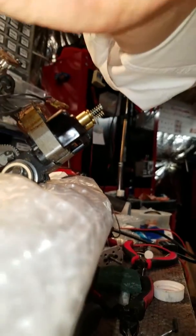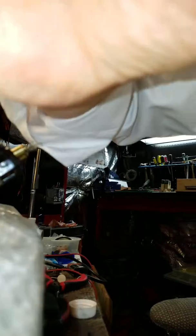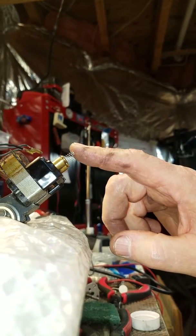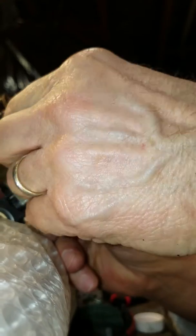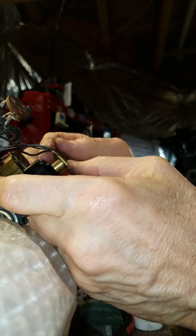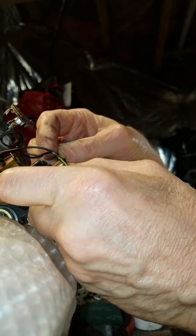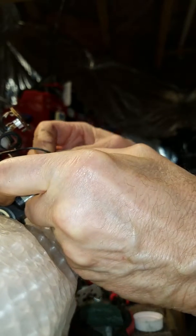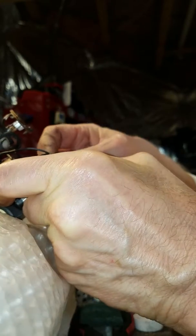We'll just see if I can put this anywhere. Not bad. What I do is I push the spring down with my thumb, and I expose just the tip of the spring and the edge, and then I bring this over and slide it under my thumb, and then slide that on. So we've got a nice tight fit and the spring is underneath. Then I do it with my other finger — I slide it down, expose a tiny bit of the spring so that I can capture it, and then I slide my little cap down. Make sure you don't miss. If you pull the cap off and the spring isn't really caught in there, then parts go flying across the room.